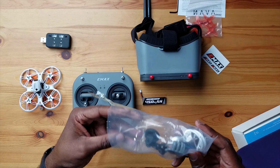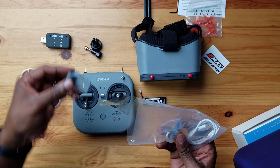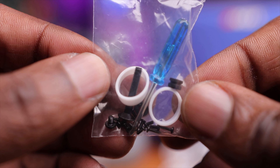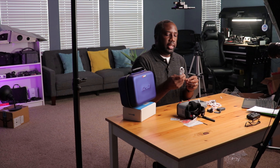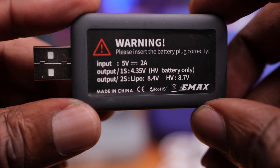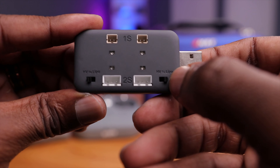Let's take a look at the accessories, which is pretty cool. You have a charger — that takes the risk out of not knowing how to charge it. You have some mounts, a clip, and a zip-lock bag with a tiny screwdriver and some rubber bands for your battery. Here's your micro USB to USB-A cable to either charge or connect to the computer. You can charge two batteries at one time, and there's a switch for lipo or high voltage. This is a high voltage battery at 3.8 volts, so make sure it's set to HV when charging.